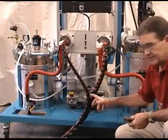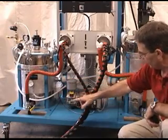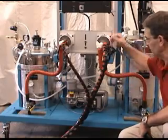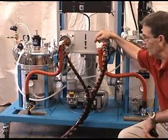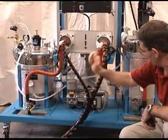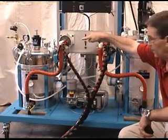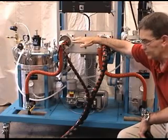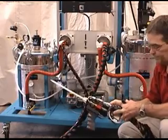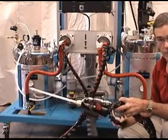The system is designed so that once the tanks are full, material is fed from each tank through a feed hose into a gear pump where it's put in the correct proportion. The B side and the A side are both fed to independent gear pumps. Those gear pumps proportion the material and feed it out through the dispense hoses to the dispense head. This can be handheld, stationary, or robotically mounted.